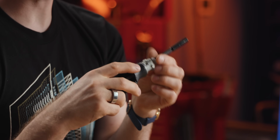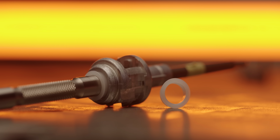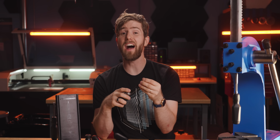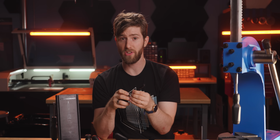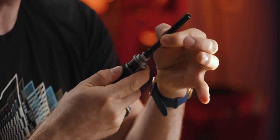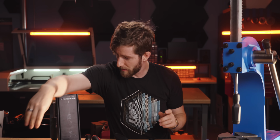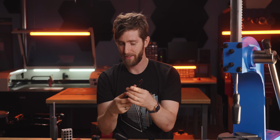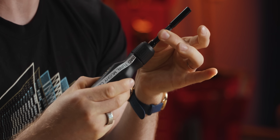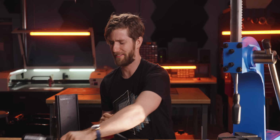hollowed out circle. While we were fixing the ratchet mechanism, another thing we played around with was the tolerance of this Delrin ring that holds the shaft in place. We settled on a 5 thou gap between the sleeve and the shaft, finding that it was the best compromise between a solid shaft feel while still allowing good ratchet movement. There's a prototype here that has a tighter collar. Yes, here we go. Oh, the feel of this is not good, but that's in the past.